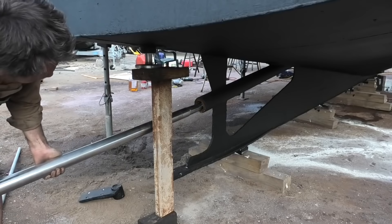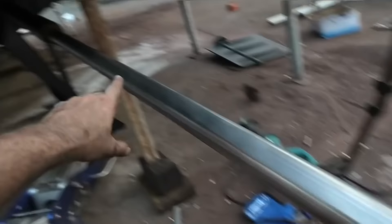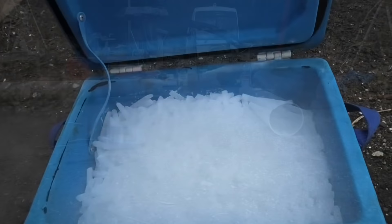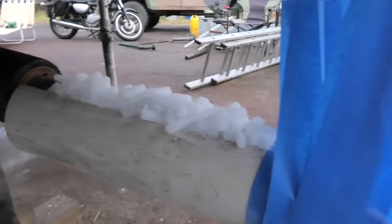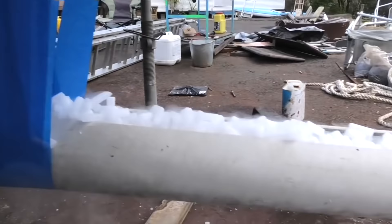We've hit a little snag. I've put a bit of lubricant on this, but it's getting really tight in this bearing. I think the reason is you can feel here where the shaft's worn — presumably the bearing's been machined for this slightly narrower section, and it gets a millimetre or so thicker here, which I think is more than enough to bind it up really tightly in the bearing. Just back now from BOC, picking up some dry ice pellets, so we'll give that a shot on the prop shaft. Just got it suspended off the rudder post with dry ice on top, bottom and sides, so we'll let that sit for a while and see if we can get it in.